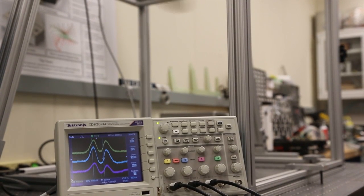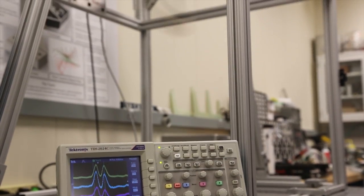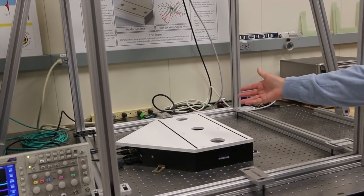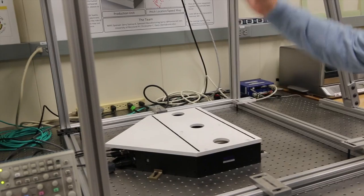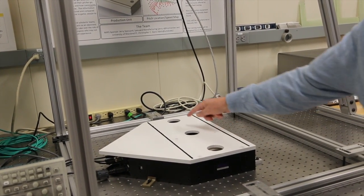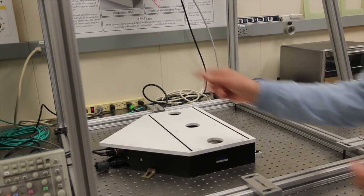You can see that the peaks move further apart as the ball got slower. Send it back up to 30 miles an hour, John. So this is the electronic home plate. There's a curtain of invisible light coming up vertically through these two slots, and there are three photo detectors that detect the light scattered from a baseball as it goes across the plate.